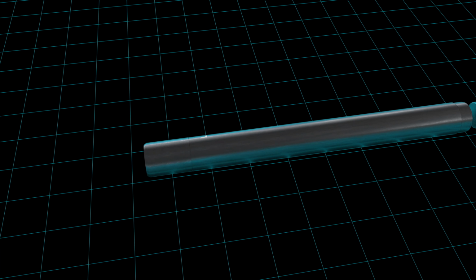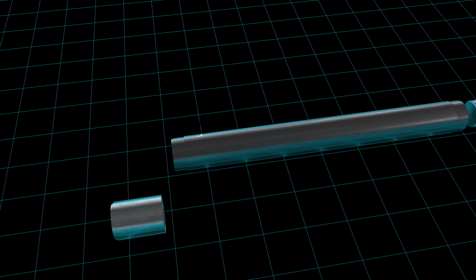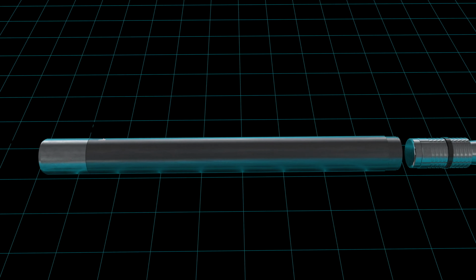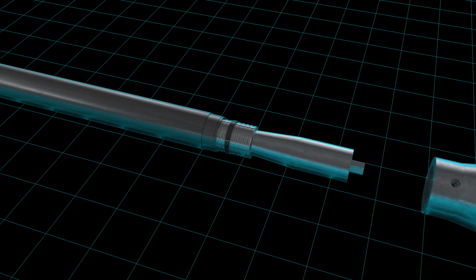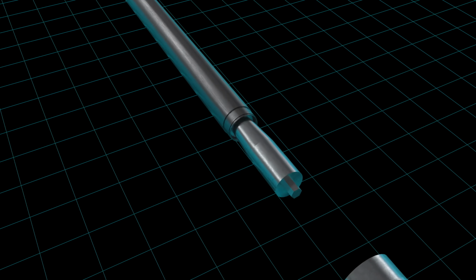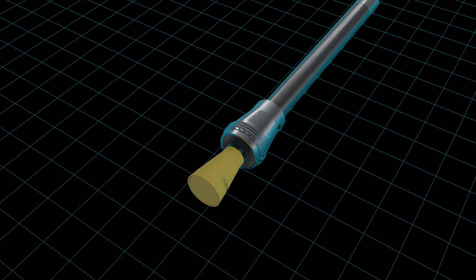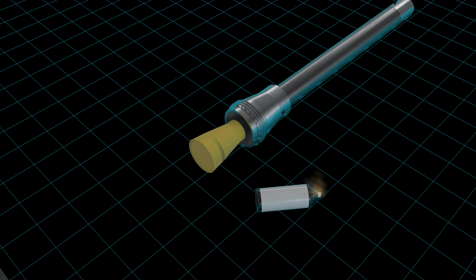Loading. Remove the core lifter case from the inner tube and replace it with the smooth lifter case included with your kit. This will ensure that the TTB plug will deploy from the inner tube correctly. Now, insert the TTB plug into the top of the inner tube, cutting the cable tie once the feet have been fully inserted. Thread the loading chamber onto the inner tube, then thread the yellow foam seal onto the upper threaded section of the TTB plug body.